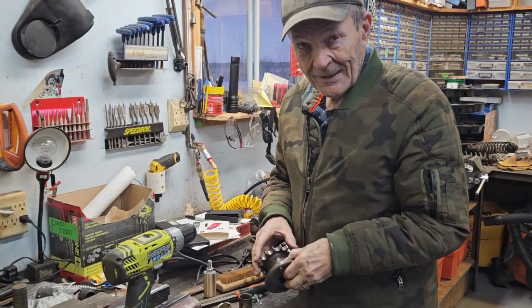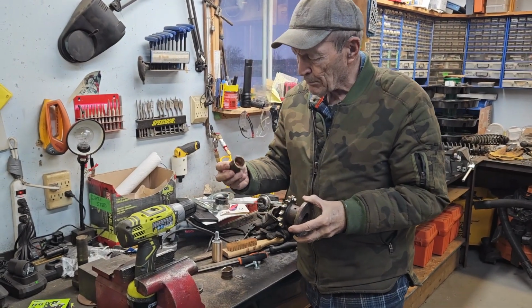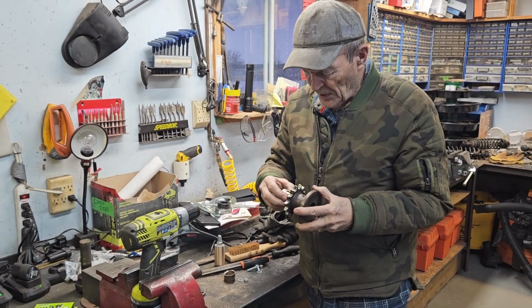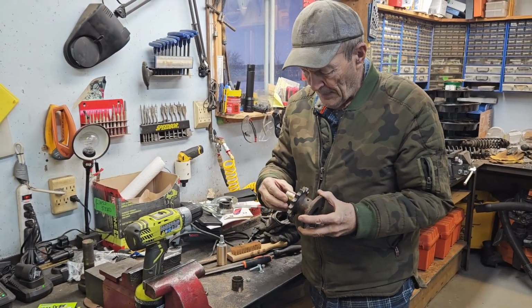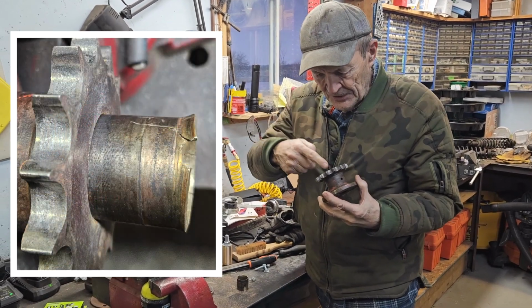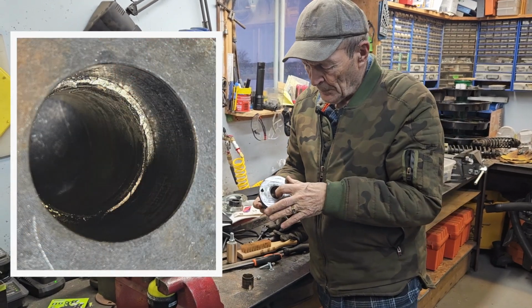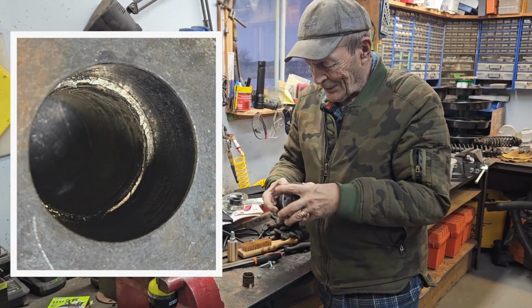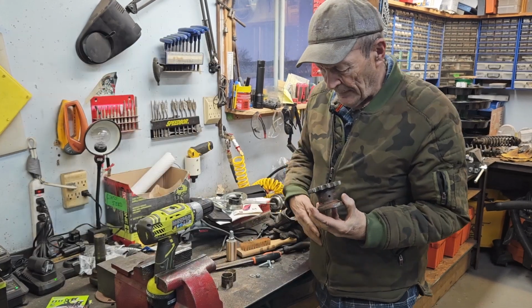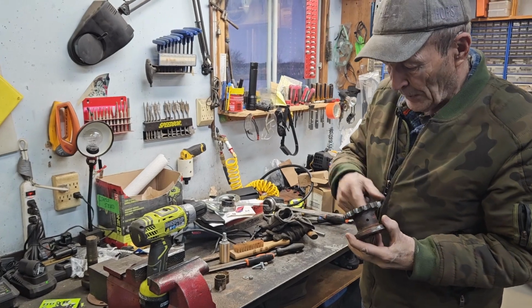Pierce's snowblower drive shaft broke. This sprocket originally had a bronze insert, a bronze bearing I guess you'd call it, but the bronze bearing was all worn and chipped. It actually slipped out of the sprocket here, and it was sticking out a quarter of an inch and broke. So anyway, I wanted to get a new bronze bushing for it.